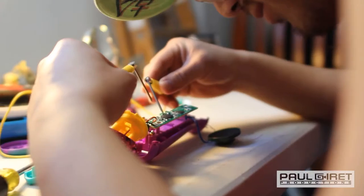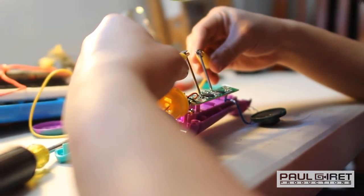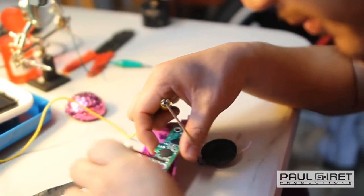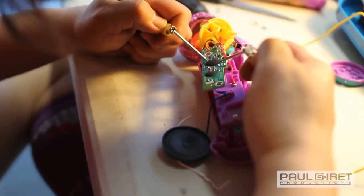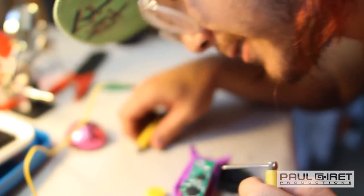You look at the circuit and you look at the traces and you try to trace the flow of where everything's going, and it's easy to see that you either have a chip, a CPU, covered up in the black blob, and then sometimes you have another second chip like an analog to digital converter or something. And so these are hot points where audio is being changed, and so you might connect one of those points and make an extra connection to a discrete part like a capacitor or a resistor, and so you're making this jump to affect a different change. Oh, that's the switch.